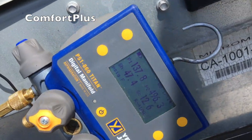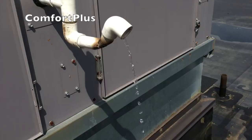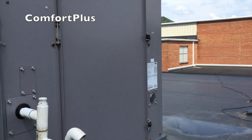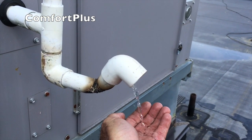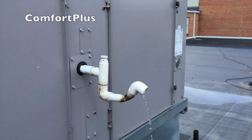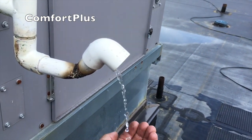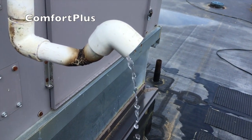The thing has a pretty substantial delay when the power has been off — about eight minutes — so in eight minutes I should be able to let it pull the rest of the refrigerant back in through the suction side. The other day the suction pressure was about 35 PSI. Baby's making some moisture — it's about 70% humidity in there. The fan has no way to slow itself down when only one circuit's running, so you get no dehumidification set up like this.